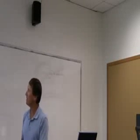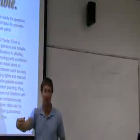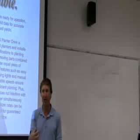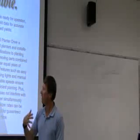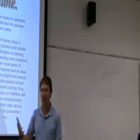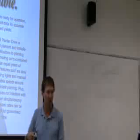What this is actually a controller that instead of increasing the rate using valves down here, has a little serial port, like you said, in the back. And on that serial port, the input is like a rate change. So I can input my change of the rate. I can say, okay, instead of putting on so many seeds per acre, I'm putting on more seeds per acre, just like we decided with the liquid application. And then it measures the speed and controls that drive.